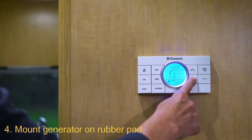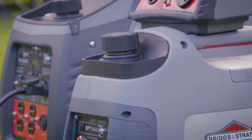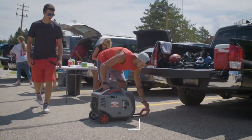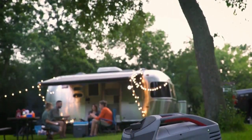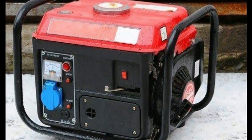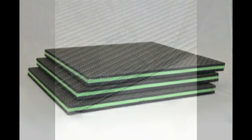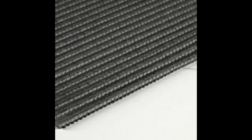Number four: mount the generator on a rubber pad. It is important to avoid hard surfaces. Give your generator a soft landing — if you try to mount it on wood boards or concrete, you are inviting more vibrations, more noise, and more problems. Run away from metal surfaces too. You can place it on earth, which can reduce vibrations. Setting it on an anti-vibration mat or padding is a better idea. Also look for thick heavy carpets and lay your generator there — you will notice a massive difference. Any material that can absorb extra sound and vibrations is ideal, including unused blankets and old clothes.